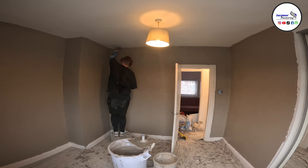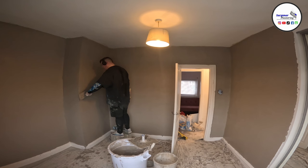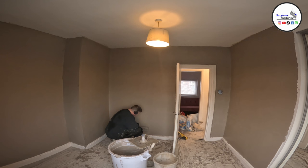So that would be my go-to in medium to low suction jobs where I'm looking for the plaster to not hang about for too long. So the likes of this, I checked the walls, they didn't have high suction. The suction was low on these ones, so we used PVA instead of SBR, and that allowed me to trowel this job up faster than maybe I would have if I had used SBR, because I had help from the wall sucking moisture from the plaster, which basically makes it set just slightly faster,